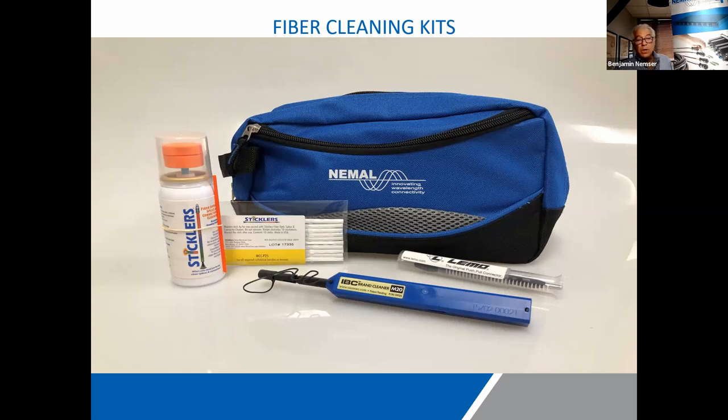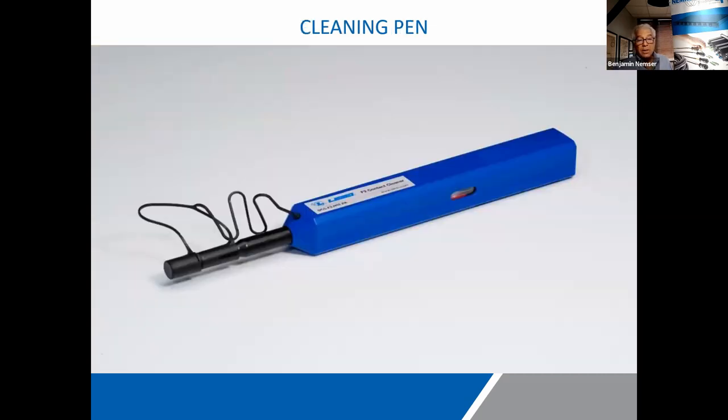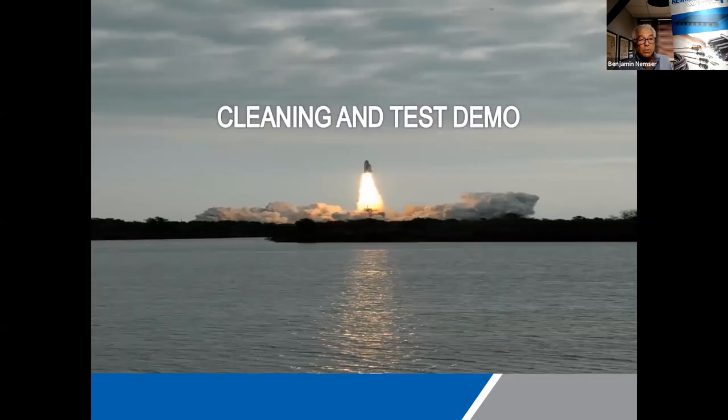So many, many things we use to keep these connectors clean. This is a typical cleaning kit. You can buy cleaning kits, as I said, for all the different diameters, as well as with specialized tooling. You can see that this particular kit has a LEMO alignment sleeve tube. And if you're cleaning LEMO SMPTE connectors, you are going to need to remove that alignment sleeve to actually reach the surface of that ferrule to properly clean it. So that's something that would come in that kit that you might not need if you're doing other types of connectors. And these click pens are available for all the different ferrule sizes. We'll give you a demo of that. They're really a great, great tool to use.